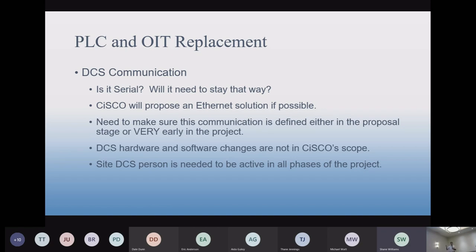And Allen Bradley is very finicky about talking serial protocol with a DCS. You might say, oh, no problem, but trying to mesh protocols with a DCS, nobody really wants to do it. We've got plenty of sites where we struggle with serial communications. Usually the result is that the DCS has to be upgraded and a new card has to be put in. We've been able to fix it a couple of times by changing our equipment, and we think we've got a good serial part now.